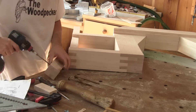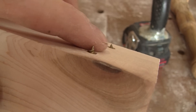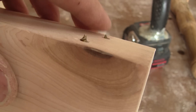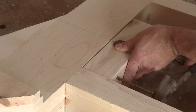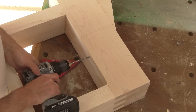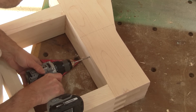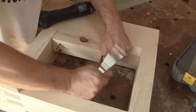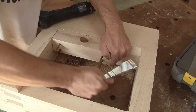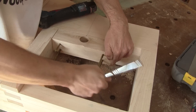For this block, I'm going to use long fifteen centimeter screws. I screw them up until they stick just a little bit and mark the frame. After drilling some pilot holes, I can screw the block in place. But this is not that easy — the screws are so long that I have to use several tools.